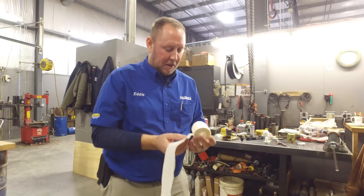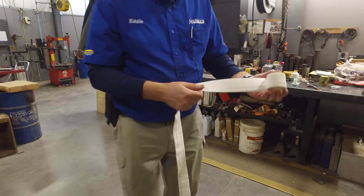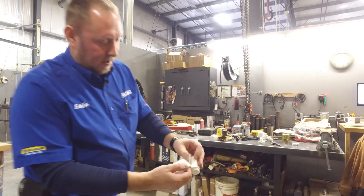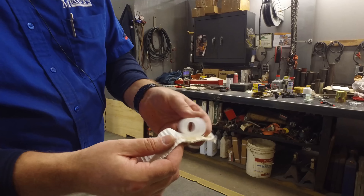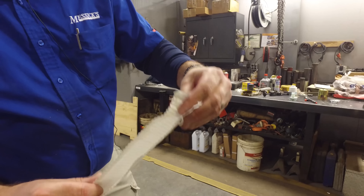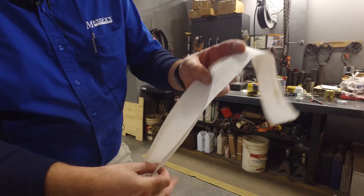So as you can see here, it's open at the top — this is where your fuel is coming in. They actually have it glued together down at the bottom, forcing the fuel to go through the filter and not allowing it to just run down through those channels. We have the Kubota one unrolled laying on the floor. Now we'll unroll the cheaper version to see how they have that one put together. Just like on the Kubota, they do have a little bit of glue forcing the fuel into the filter so it can't just go straight down through.